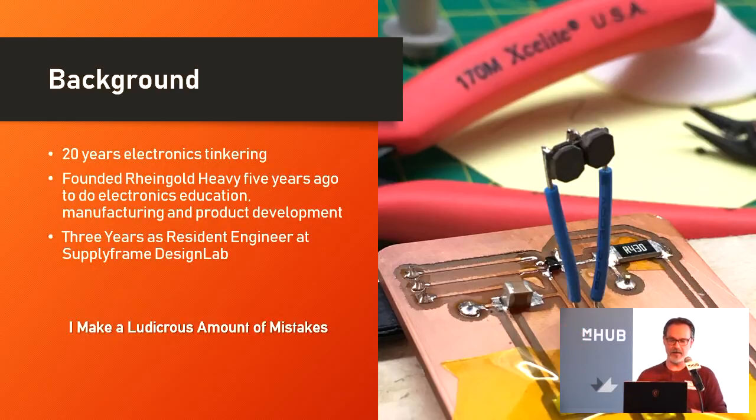You can see this example I have right here, which is a pair of inductors because I screwed up on this design and didn't have enough inductance for this particular boost converter. These were some high-watt ultraviolet LEDs, and they just weren't giving me the amount of ultraviolet flux I was expecting. It turns out I just wasn't getting enough inductance into that boost circuit to actually give me the current to drive it.